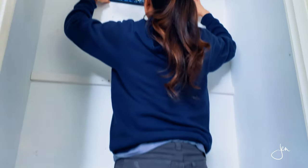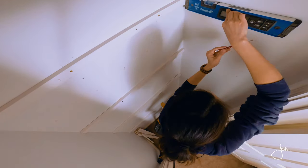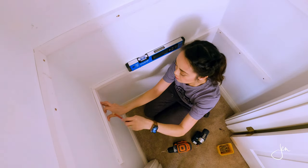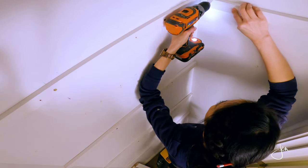Let's talk briefly about span limit. Span limit is the maximum distance apart that you can place the shelving supports before the shelf is at risk for sagging. Span limits can range from 18 inches to almost 5 feet depending on the material you choose and the load it'll carry. Since this is a bedroom closet holding extra linens and miscellaneous items, I'm not too concerned about exceeding the span limit, and the back cleat runs the full length of the shelf offering more support. I used a stud finder to find the studs, pre-drilled pilot holes, and screwed the 1x2 supports to the wall, making sure each cleat was level and even.